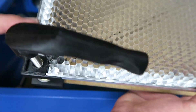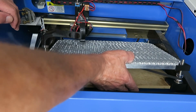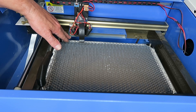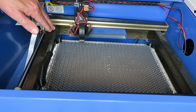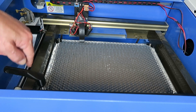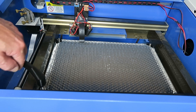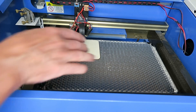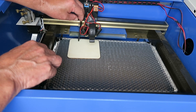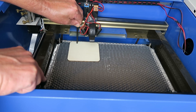On the K40, the handle goes in the bottom left-hand corner. The bed I've placed almost level with the exhaust vent, which is the limit of the laser bed anyway, and forward far enough that the handle doesn't foul anything, with the left-hand side up against the metalwork just to keep things square. I can raise the bed up, put my piece of work in place, and use my little guide tool on top of the gantry — and it's just at that point where it's focused.